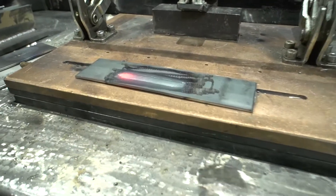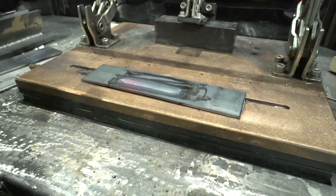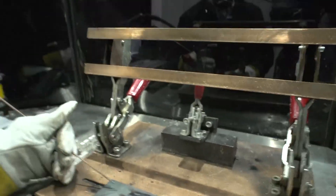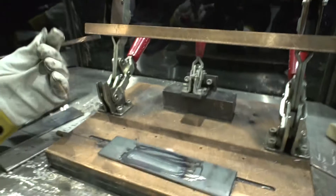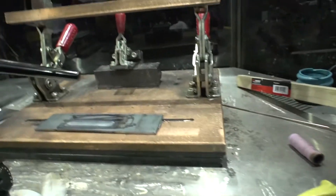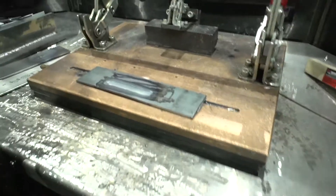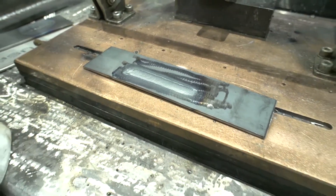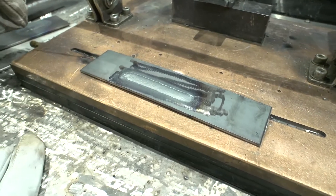Very good. And again, as I stated, in order to make a good-looking weld, you really have to have good clean metal. Any surface contaminants — even scale or rust on the metal — even when I'm welding with TIG, since it's an art, really, even the rod: I'll always have sandpaper with me and I'll sand that coating off. Everything has to be really clean if you want to make a really nice-looking weld.